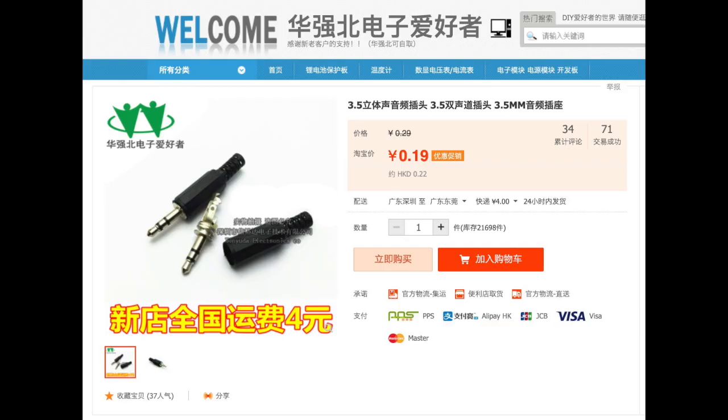Depending on what type of headphones or earbuds you have purchased, you may want to hook that up to a jack. This is a 3.5mm stereo headphone jack — the same size used on our smartphones. Alternatively, if you already have some smartphone earbuds that you don't use or that are damaged, you can just chop off the other end and solder in the crystal radio earbuds.